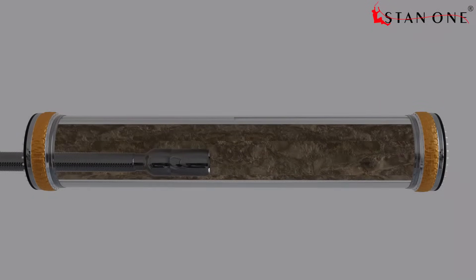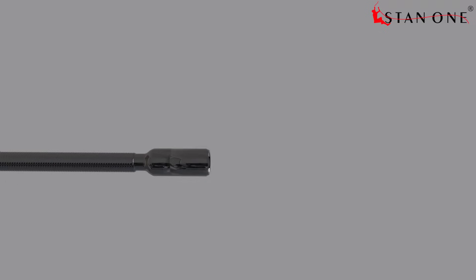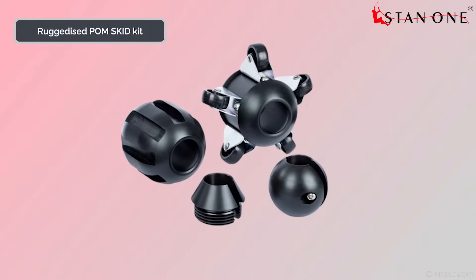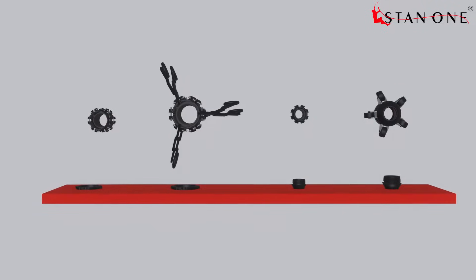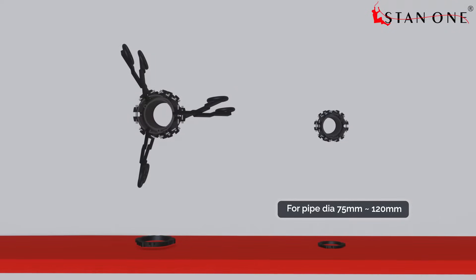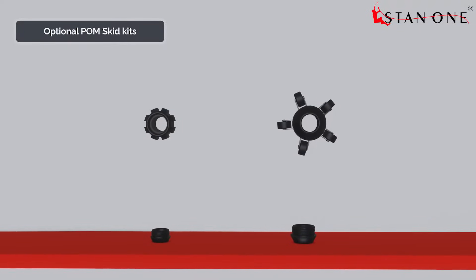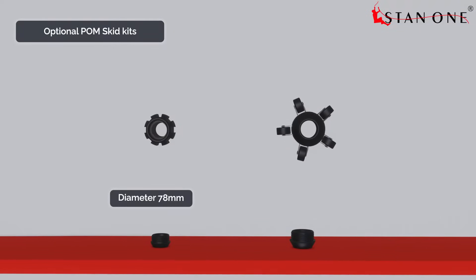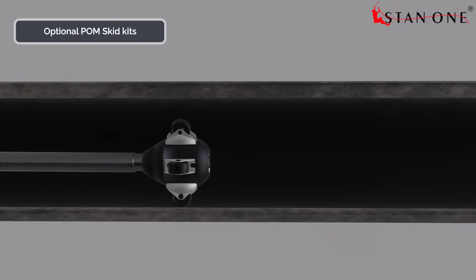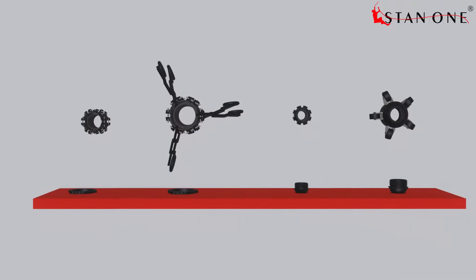The LPIC provides smooth inspection in pipe sizes of 60 mm diameter without any additional accessory. You can also increase the inspection capability by attaching camera centralizers or an optional ruggedized POM skid kit. Centralizer options are available for diameters of 75 mm up to 120 mm and 125 mm up to 300 mm. Ruggedized wheeled POM skid kits are available in 78 mm and 134 mm diameters, ensuring the camera head remains secure inside corroded pipes or pipes with blockages or undulations. The choice of centralizer design depends on the specific application and pipe characteristics.